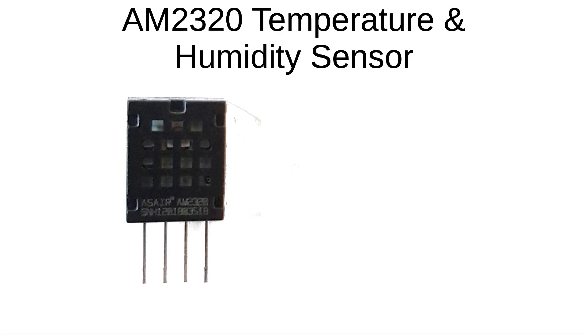The temperature sensor I'm using here is the AM2320. This is similar in appearance to the DHT11 which I've used in previous projects. The AM2320 can use a single wire interface like the DHT11 but it also includes support for I2C, which is what I've used here. I've created a separate video explaining I2C which you may want to watch if you're not familiar with how that works, and I'll explain a little bit more about this later.